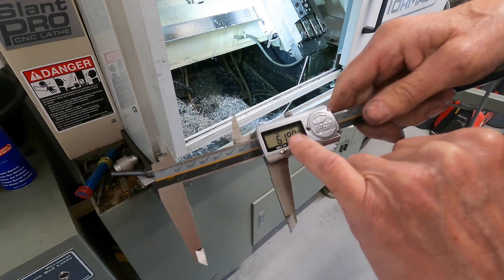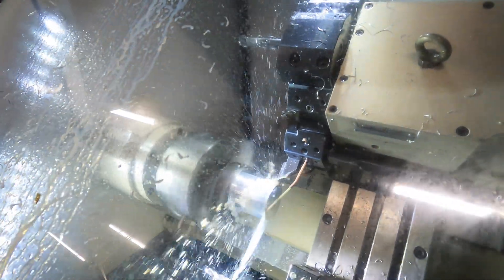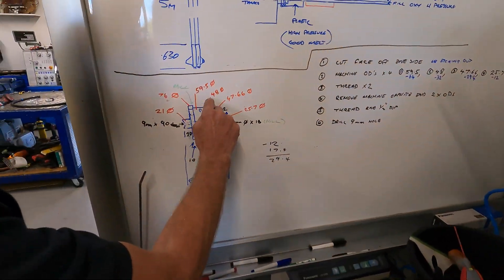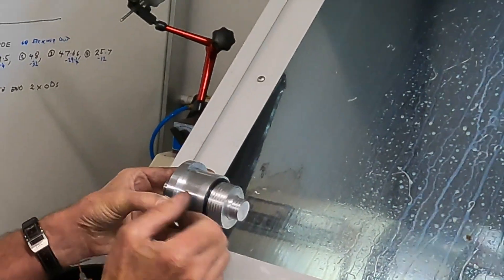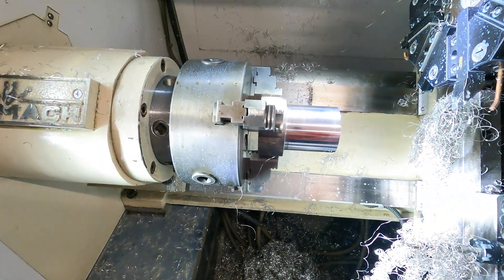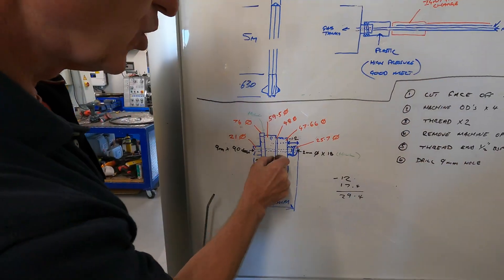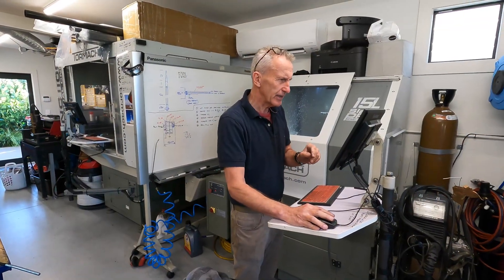It's 61.99. I've taken from 76 up here down to this — it's all like that. This is the final cut, that's the piece of machining at the moment. The finish is incredible. It'll be a small land 2.6 millimeters wide, down to 48 which is where I sit my O-ring. Here's the new O-ring seating, so the final diameter is 48.